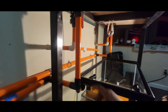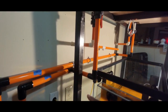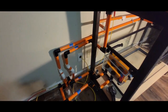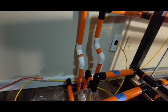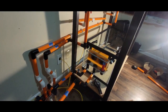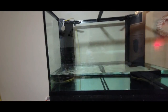What I did was connect the right drain of the main tank to the right side of the anemone tank, and we had that trident down in the basement. We connected each right side to each side of the trident — so the right side of the main display and the right side of the anemone tank both connected to one trident. The left side of the main display and the left side of the anemone tank both connected to the other trident.